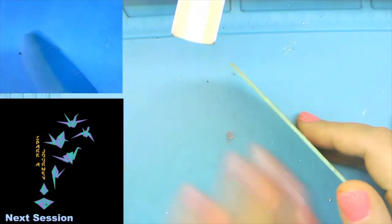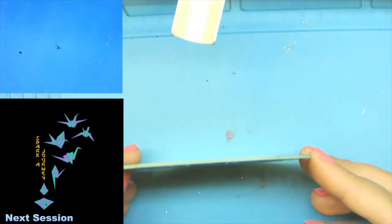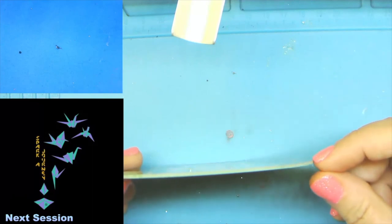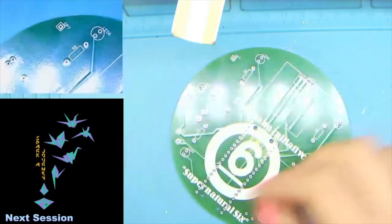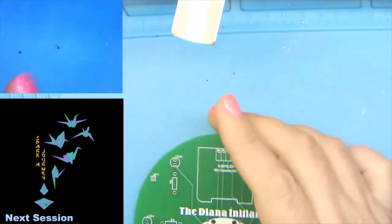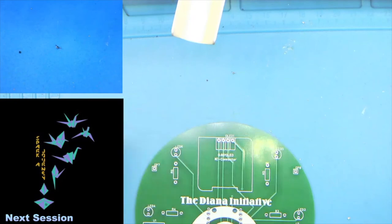And the reason we start with resistors is that if you think of your board on this flat plane, you want to build it up in increments. So we want to be able to keep all of our resistors flat against the table. So we'll put those on first, and then our LEDs are going to be taller, so we'll do them next, and then the buttons and so on and so forth. Later we'll have much fun with solder pins. All right, so